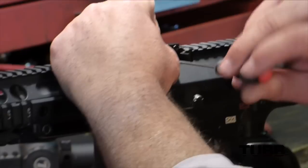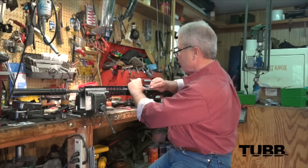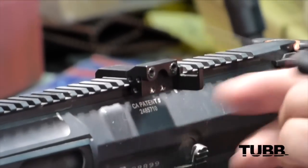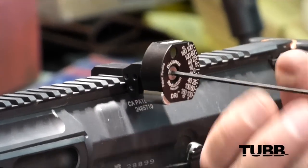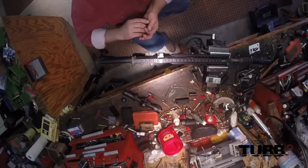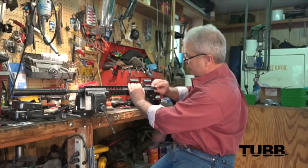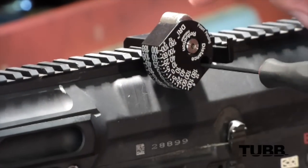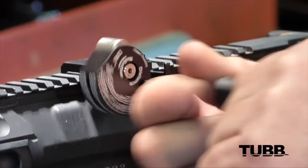Just run these little Allen wrenches in. You have another option to further check, recheck, or move it slightly. If I had gone ahead and had this piece on, I can also adjust it — the back screw here and the front screw through this hole. So I can slide this forward and aft with this piece on, and obviously when I tighten this up, I'm going to get it nice and snug.